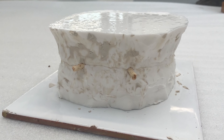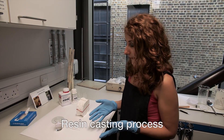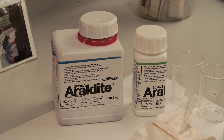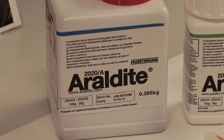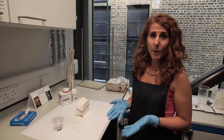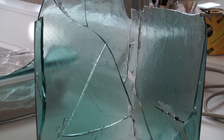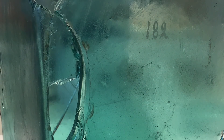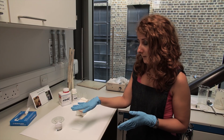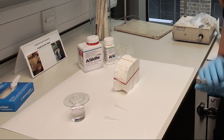I had to prepare the epoxy resin about an hour before I start casting. The reason for this is because when I mix the two parts of the epoxy resin, I have to mix it really, really well, and this causes a lot of air bubbles within the resin itself. Even though the urn has a lot of bubbles within the glass, I still do not want an excess amount of air bubbles within my resin fill. For this reason, I left it for an hour and now it's time to pour it into my mould.